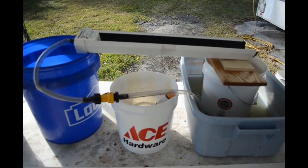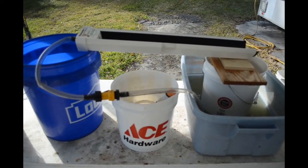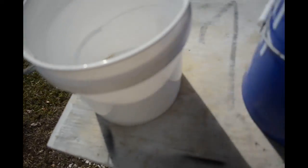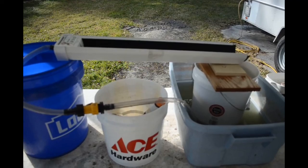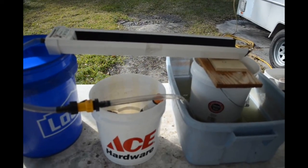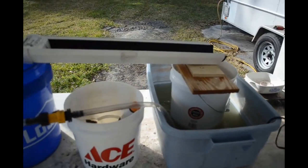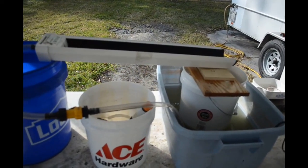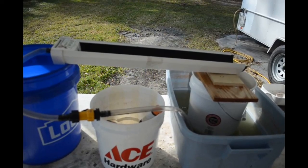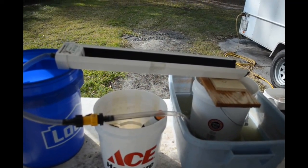I think I'm running out of time for today — I might be able to run it through one more time, then I need to go brine some chicken so it can go in the smoker tonight for dinner. Everything has been through four times, but I'm really out of time. Here are my concentrates so far — still a tremendous reduction over what I started with. Tomorrow I'll run this stuff through at least one or two more times. It's actually fairly quick and a lot less laborious than panning. I've decreased the slope of the sluice and will decrease the water flow now that I've got most of the big stuff out, to see what small stuff I can capture with less slope and less flow.